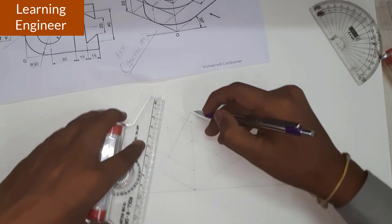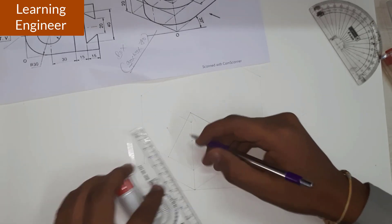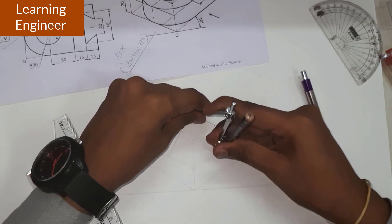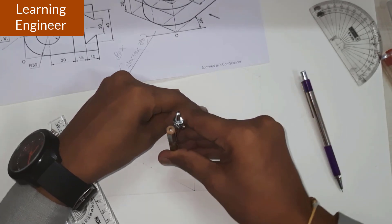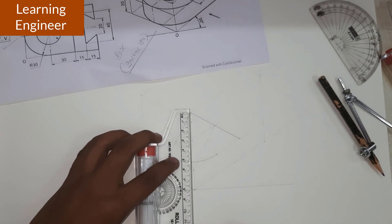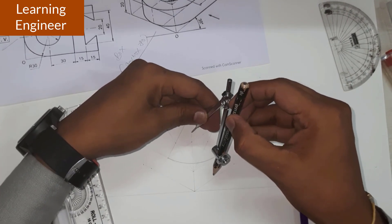From the smaller diagonal, we draw and join these points to find the center point of the circle — wherever they intersect gives the center point. We require only one center here. Join these two points like this. At the same time, we have to come 20 mm below and draw a line — because the thickness is 20 mm. I mark 20 mm below and join from here.